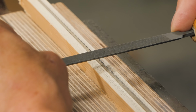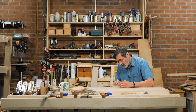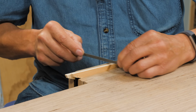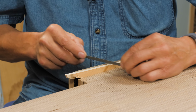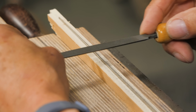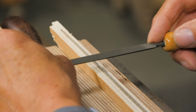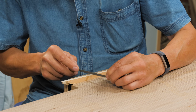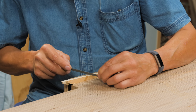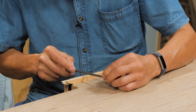Oops. And we're going as much on feel and touch as we are anything else. And I have the angle where the saw file is sloping towards the toe of the saw, just that little bit. I have it locked in my muscle memory now. And I wouldn't recommend a finer tooth saw because after 19 points it definitely gets more difficult to sharpen them. 16 is a good size, but that will be more aggressive.